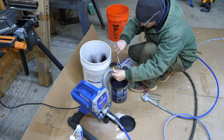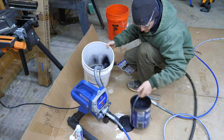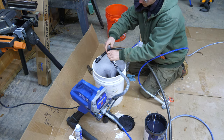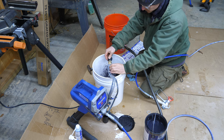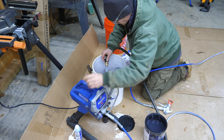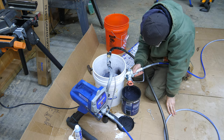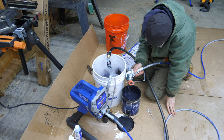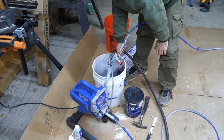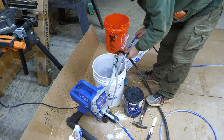I don't see any major defects in the second coat — let's cross our fingers it stays that way while drying. The setup and cleanup of this sprayer took longer than actually using it. Cleanup was pretty easy though — there's a special attachment for the hose you hook right onto the suction line and use your garden hose water pressure to clean out the valve and return line. Turning the pump on gives a little extra boost, then you clean out the gun. There's quite a bit of paint left in the hose, and if you start spraying it back into the can you can save most of it. Once it comes out a bit diluted with water, go into the waste bucket. Finally disconnect and disassemble the gun and clean it out by hand.